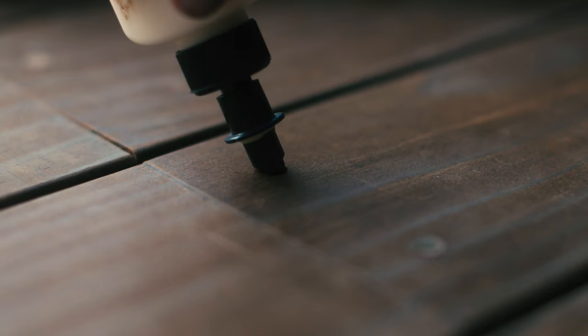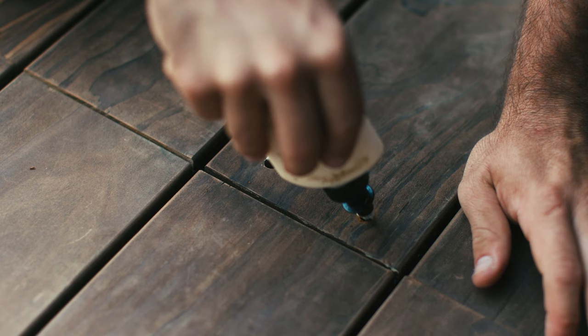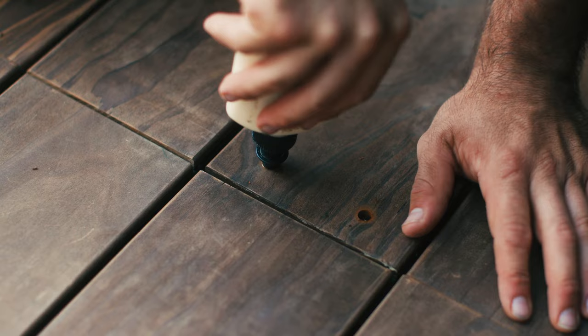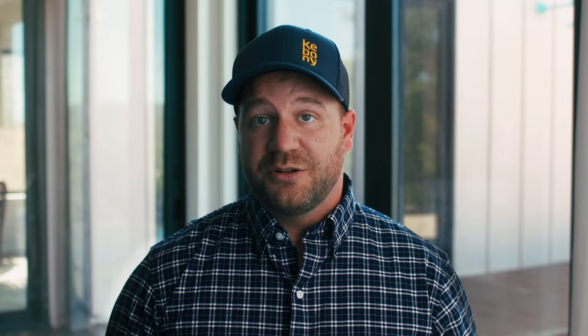With the work surface in a horizontal position, place the wood glue nozzle in the hole and push the glue bottle down — this will open the nozzle. Gently squeeze, then turn the bottle a quarter turn to ensure full coverage of the sidewall. Pull the nozzle out of the hole and this will close the holes in the nozzle. The objective is to coat the inside walls of the hole while leaving as little glue as possible at the bottom of the hole. You can glue several holes at a time and then go back to insert the plugs, as long as you add plugs before the glue begins to set. Use a rag to wipe off any excess glue that may have built up on the nozzle tip.